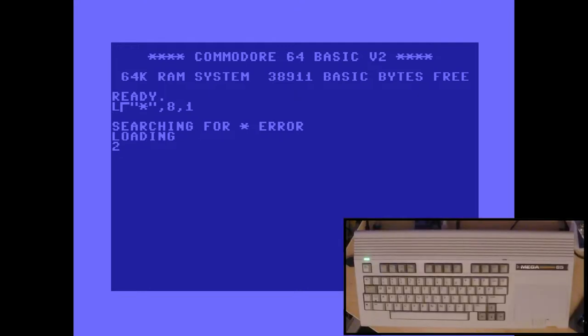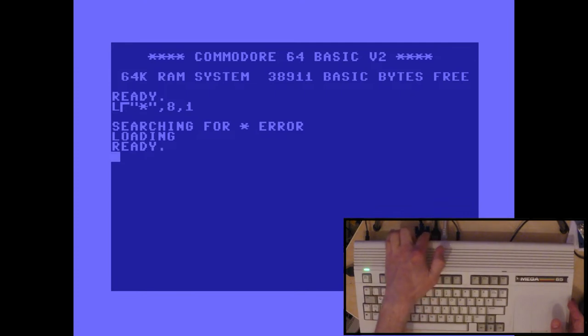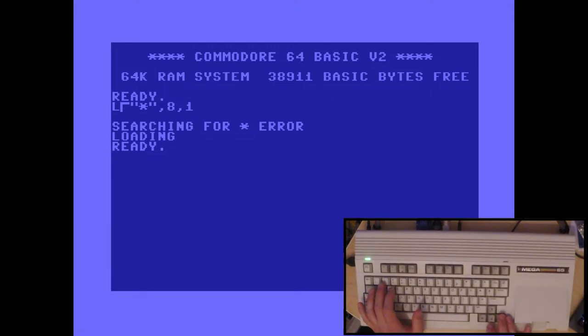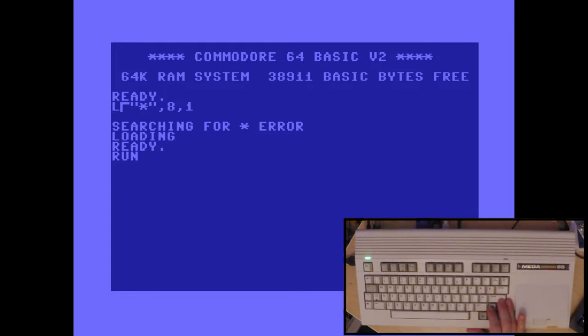Don't know if I should show you again a bit. MEGA65. You can see the cables in the backside. HDMI, VGA, there's the sound. So the sound currently comes over the 3.5mm plug because my ATEM does not like the sound that comes out of the HDMI, but there is sound coming out of the HDMI. Also one of the small problems still being worked on, but there is also in the works the audio pipeline in the QNICE CPU. So this is essentially what the MiSTer does with the ARM to filter the sound in different ways. And this will also be added, so perhaps then the sound will work better. Let's start the demo.